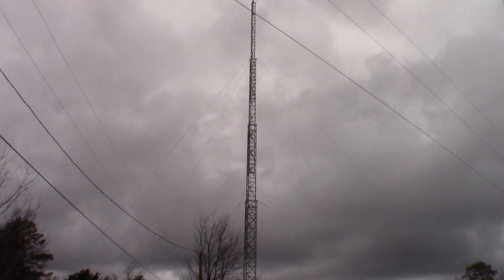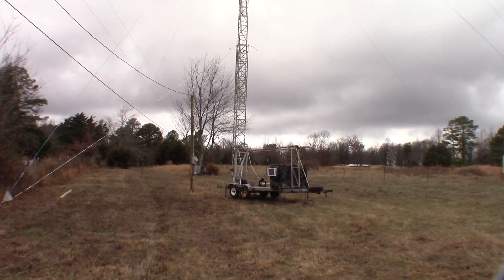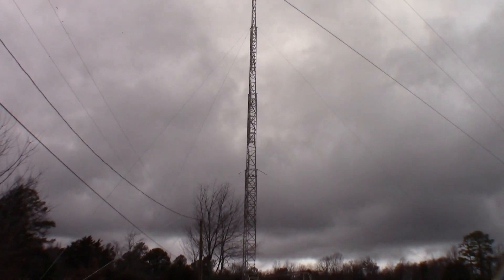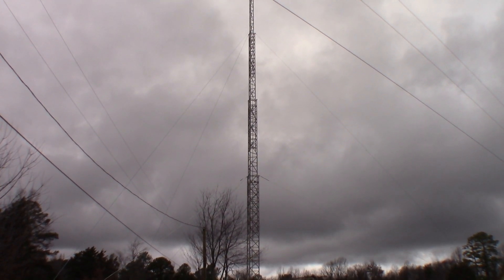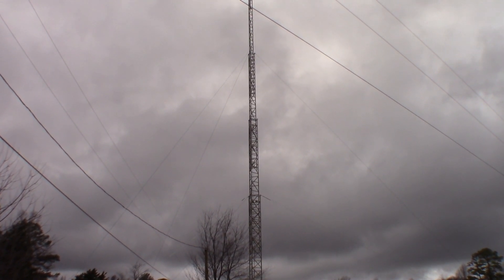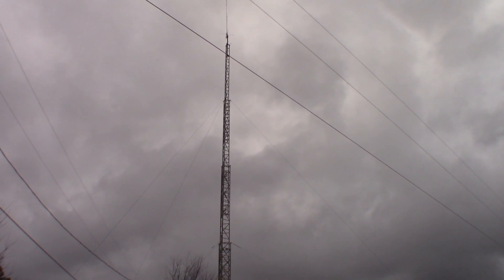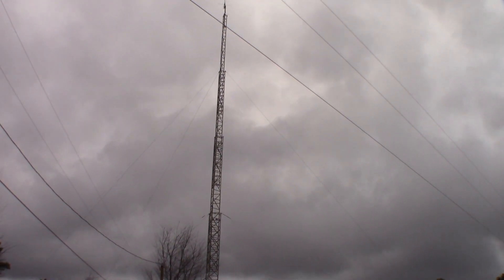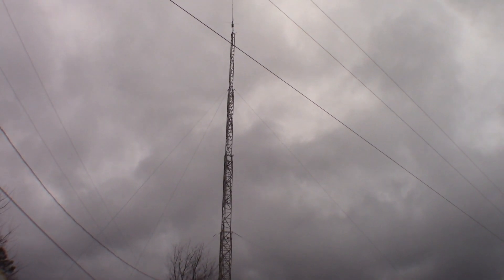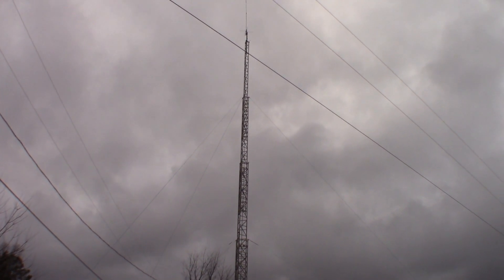We're doing pretty good. I added a new computer to the setup so I can remote in and change settings remotely. We sorted out a lot of the duplex noise issues we were having — there was a lot of crackling on the input signal during transmit. We found what's causing it and got rid of most of the problem. I need to come back and really foolproof it, but I'm going to do that once it's at full height. Overall, the KM4OVZ Rebel Renegade Pirate Repeater is up on the air and doing good. I look forward to using this a lot. With that, I'll go ahead and end the video. Thank you all for watching. We'll make another video soon with a hardware tour, although there's already a hardware tour on the North Alabama Tech Team YouTube channel. 73s to everybody.